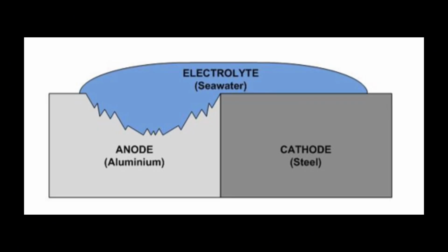We can't dive into a solution yet until we talk about how galvanic corrosion affects outboard motors like these. This type of corrosion occurs when two different metals come into contact with each other via an electrolyte. The less noble metal acts as the anode and is corroded, while the more noble metal acts as the cathode and is protected. This applies in this situation given the solution that's in place at the moment.